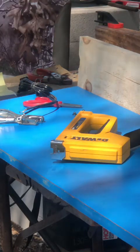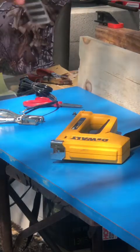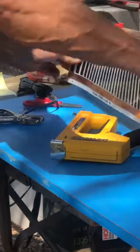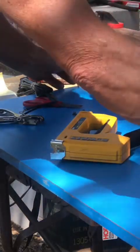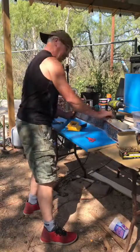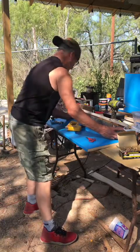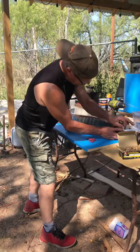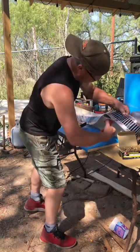And here's the heat strip, which you cut to length. So stretch that out, and then I cut it off right there. All right, put my scissors. I like to cut it just a little bit short. Tubs don't get all the way to the side anyway, just so the cord has room to wrap around better. I usually pick in between one of the heat bars. I don't know that it makes a difference.